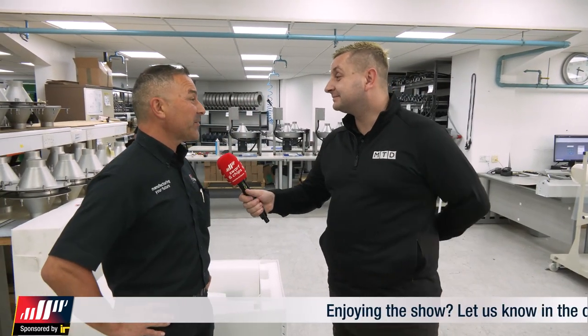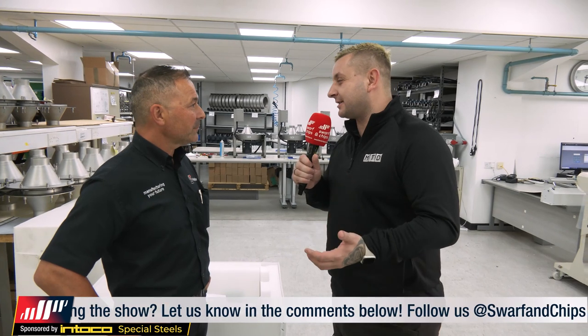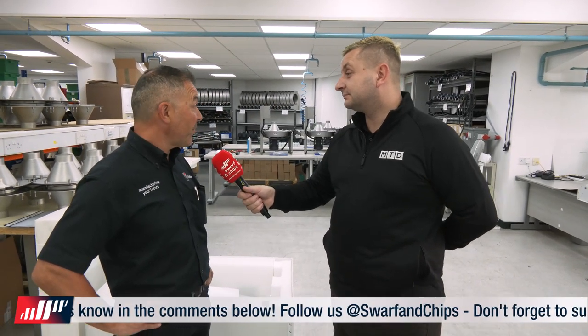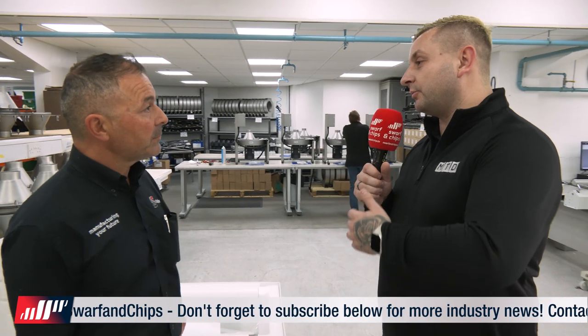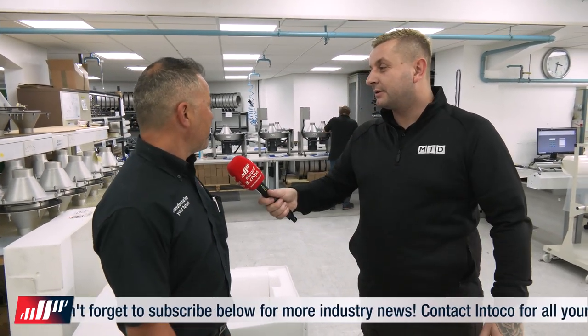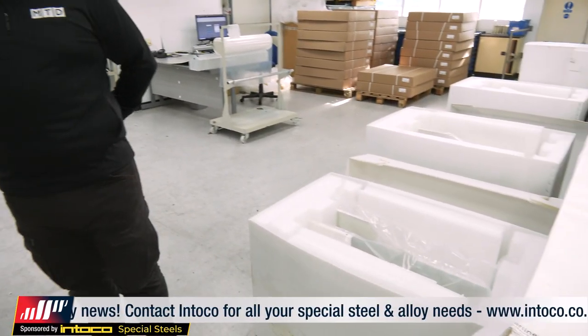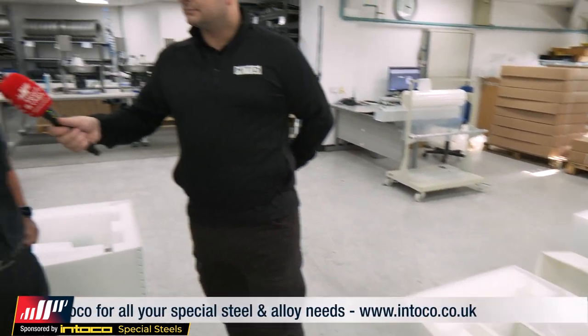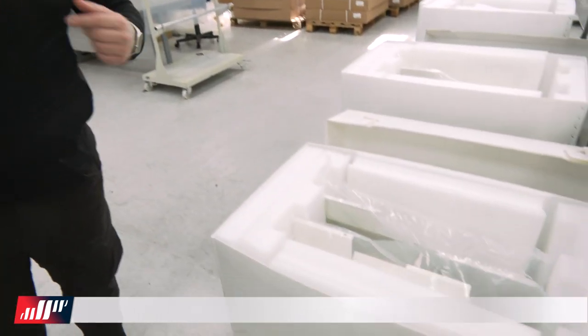I'm now in the assembly department and I'm going to have a chat with Dom about what happens up here. Dom, what's happening behind us? We're doing some electrical testing on some parts we make here for a customer. What's involved in electrical testing? We do continuity testing and also vibration testing — running up and powering up the actual equipment. Once all the testing is done, what happens to it when it's finished and ready to go? We pack it in bespoke packaging and send it out to our customers. A lot of the packaging gets decanted and sent back to us — so you're very green! And this packaging looks so nice and comfy I'm going to ship Chris back to the office in it.